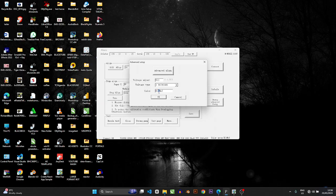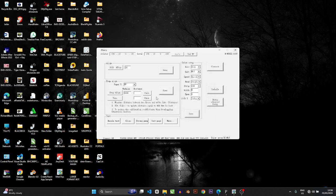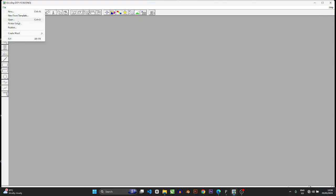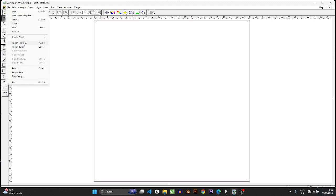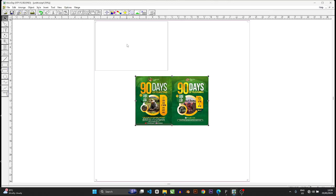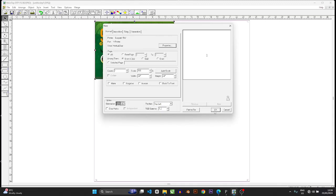Take the small cyan, cut it, and paste it before K; then take K, cut it, and put it after C. You've now recreated the configuration that matches your machine. Press OK, the machine saves it, and when you send a print it will print just as sharply as with six color nozzles. I'll go to ATools, send a job, create a new 24×24 file, import a picture with a dark or cyan-heavy design, and send it to print.